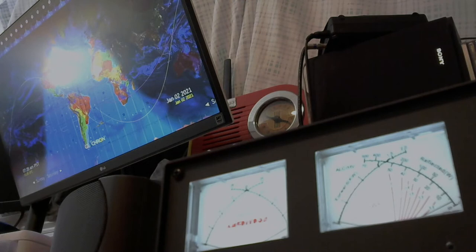So, Grayline propagation: the time when the D layer hasn't charged yet or isn't charged enough yet, and the F layer is still real high and real charged up in the dark area and the light area, it's wide open, still there, but there's enough stability. The brilliant thing is when you work right along the Grayline. Now, this is why we've done it so early this morning.